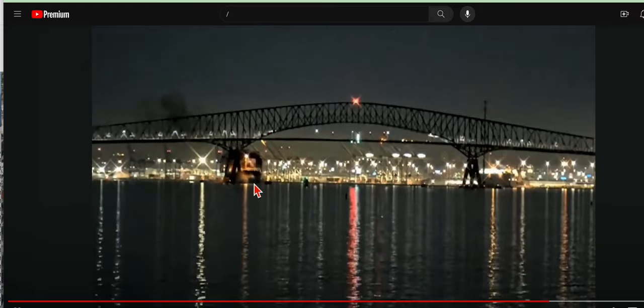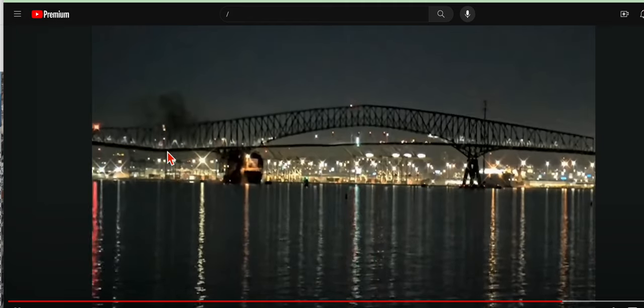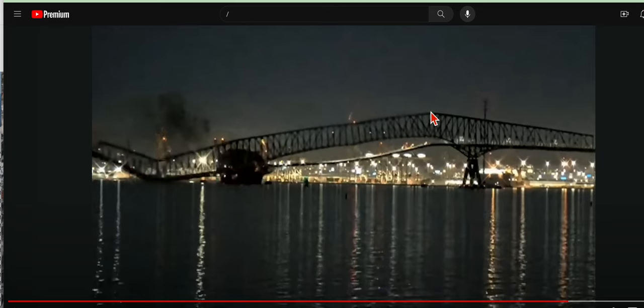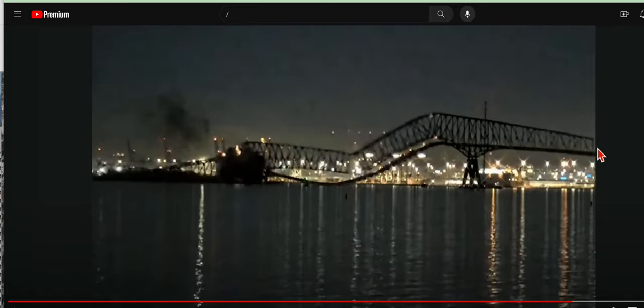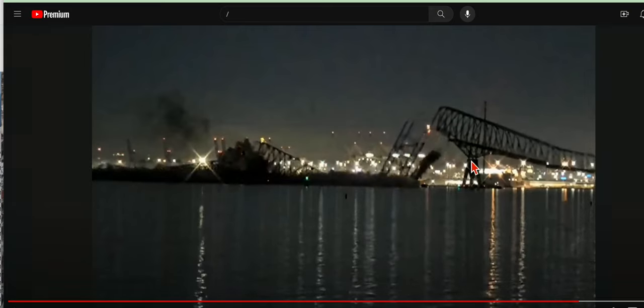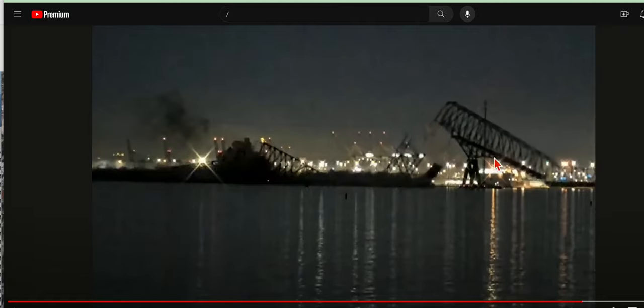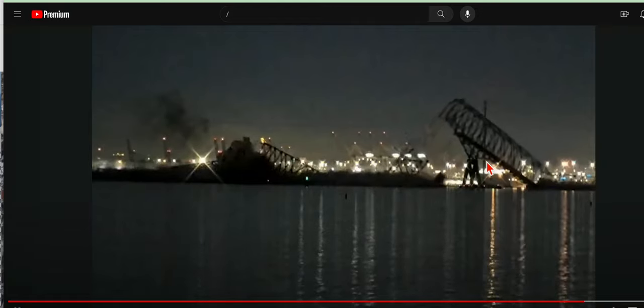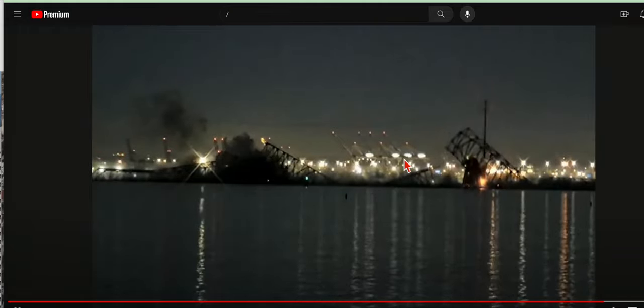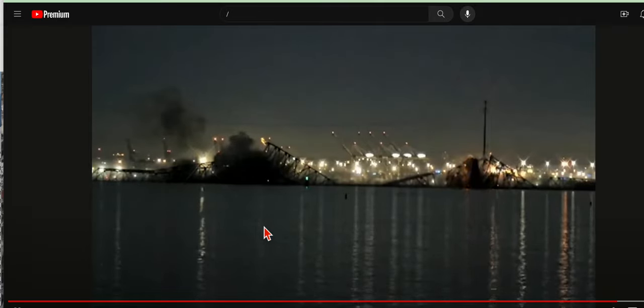The impact is here and we get our first break. Even though the impact is here, our deck drops down first, then our first break is here - secondary. This one's a compression break up here, and then this down here starts at the same time. It's pure - it just rocked it. The truss system underneath is still in place and then it compresses, buckles, slides off the joint and down it goes. Another break. All right, end of this video - take care guys, love you guys. That's this morning's video, my third rendering.